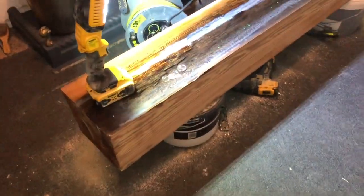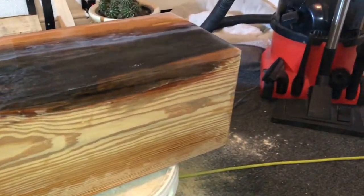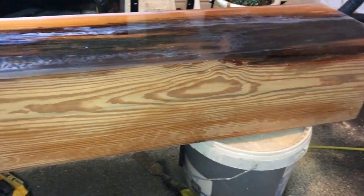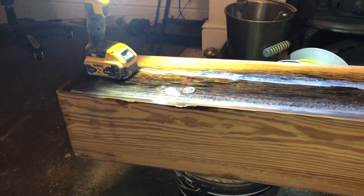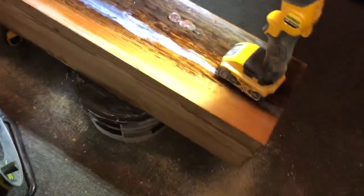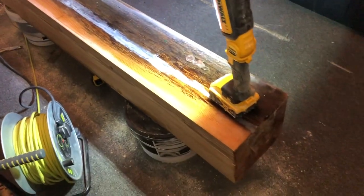Right then, boys and girls, I've taken all the ply off from around the resin. Needless to say, some of the ply has stuck to the resin there, because all that section there is supposed to be resin. So I'm going to get the sander out shortly and just sand all that. When it gets a thin finishing coat of resin with a mohair roller, you'll see it all better. You can see it by wetting it with a rag. Not bad — looking all right. I've got all the ply off around the edges and just been sanding it down. At least I'm going to have a shelf now.